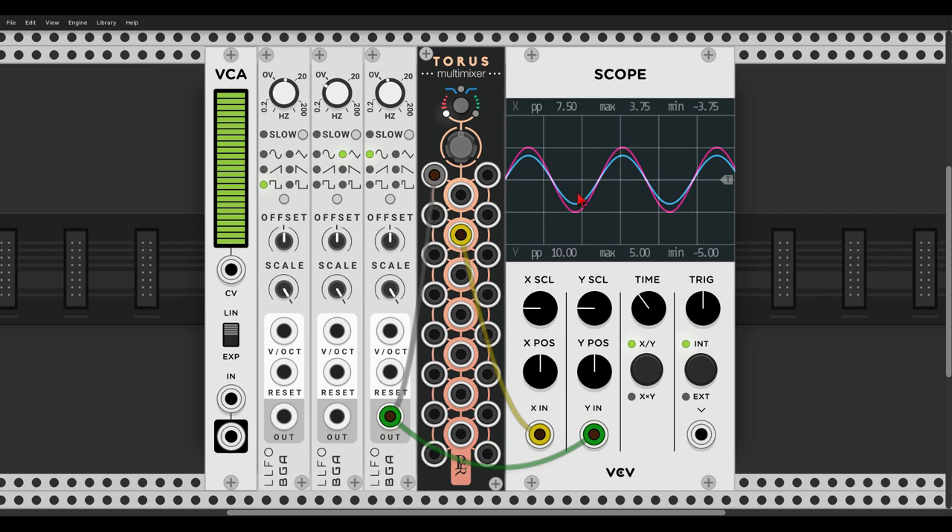You can see this is the second output now — the signal is even more attenuated, and it will get more and more attenuated as we go further down, or further away from the input. The last output is already really attenuated. This is the behavior of TORUS in the first mode, the red mode, which is called decay. As further away the output from the signal is, it will be more attenuated, and this will be the same with any input.